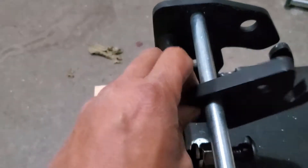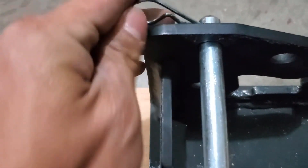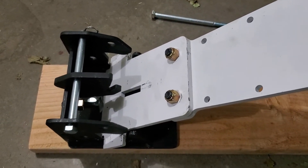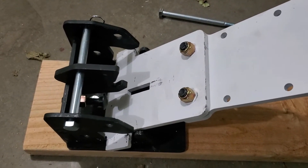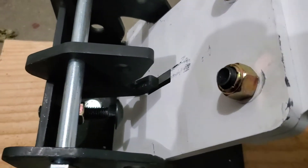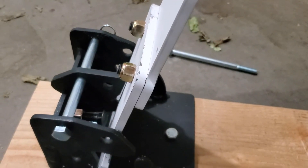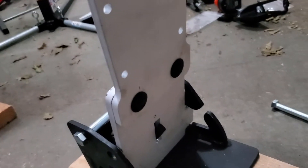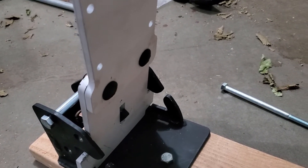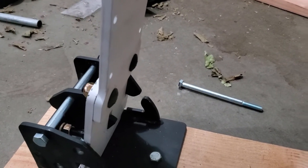Center this up, then you can take the cotter pin and stick it in the end here. You're set for a forward-falling popper. I've put my popper skin into the frame of the popper base, and you can see that it lines up naturally with the activator hook or release hook right there. The popper is oriented 180 degrees from its rear position — flipped around backwards — because you want the carriage bolts to be on the side where the bullets are coming from. In its forward-falling orientation, you set it just like that.